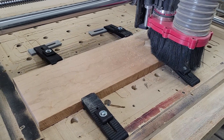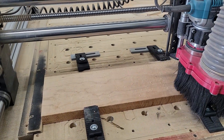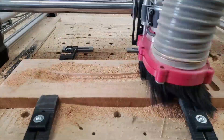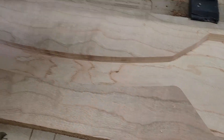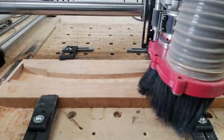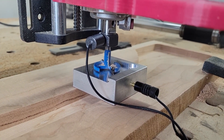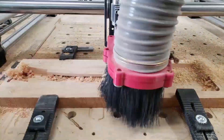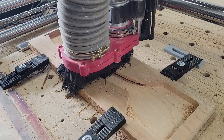Here is the start of our offset toolpath — it's just going to drive around the vectors as you saw and get this stuff cut out. Here's a quick time-lapse of what that first toolpath looks like. It does a pretty good job, pretty efficient, and the finish is really nice. If you look closely you'll see the lines from the offset toolpath — you can sand those out, but it's easier to just run the finish pass. Then we're setting Z with our T-slot bit and going ahead to cut those slots. They're quick and easy, about four minutes. Here's a quick shot of cutting out the handle at 175 inches per minute. Then this is us montage-cutting the outside and removing the piece.